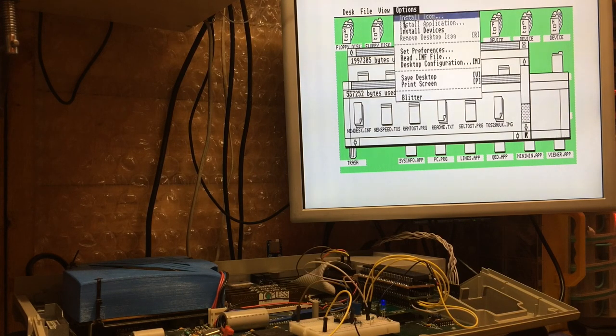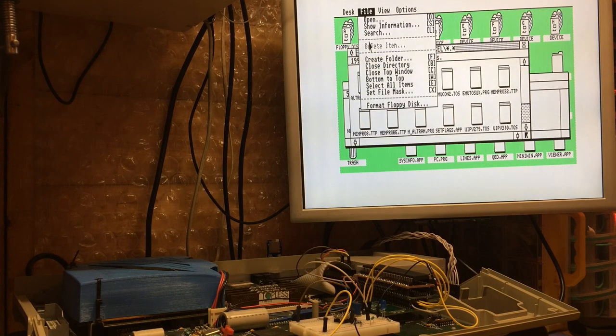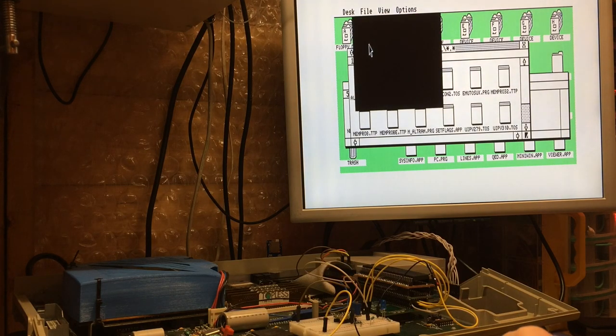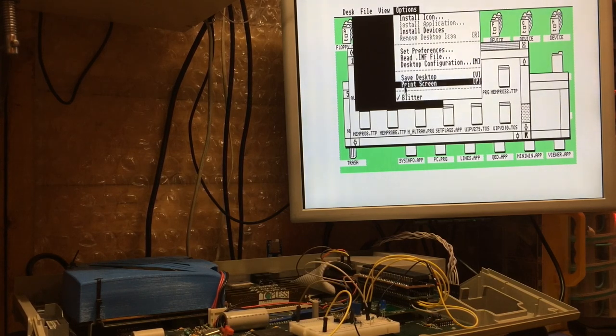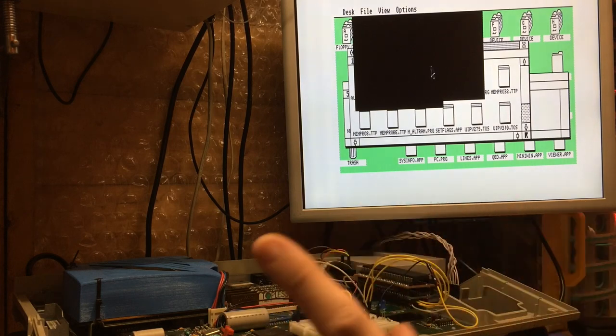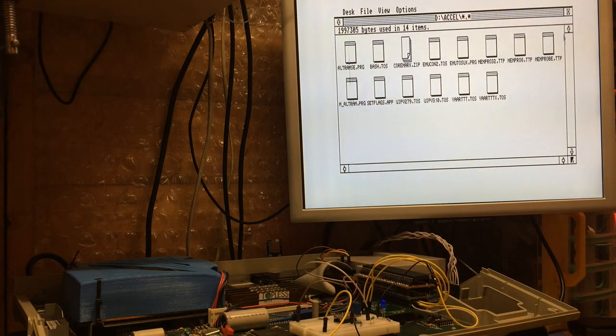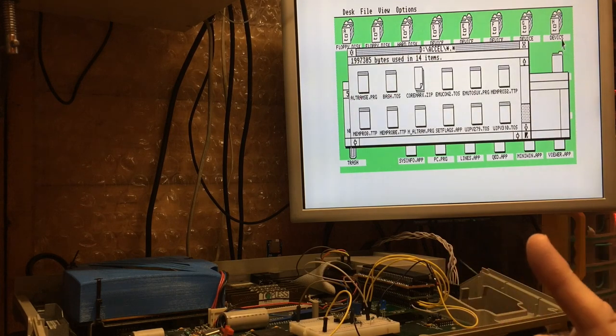So this is what I mean. Unfortunately, if I switch the Blitter on here, and then I access the menu and I come out, I'll just get a blank. My system is correctly asserting that the Blitter is not supported when it accesses that, but unfortunately there's no fallback. I need to check whether Anders Granlund's Blitfix program can work with this. It's not intended for AltRAM, it's intended for TTRAM, but maybe there's something we can do with that.